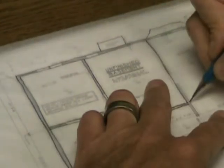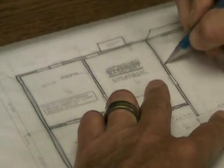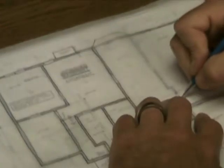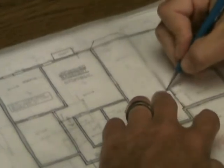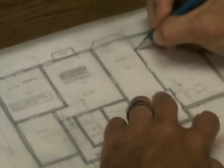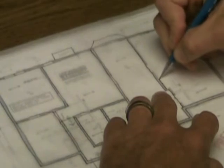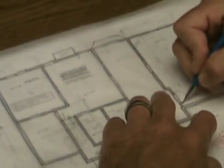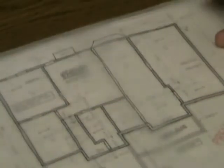You'll notice I'm putting this line directly over all the openings, whether it's a door or a window. I don't care about the particular details of how a door or window is framed. All we're looking for when sizing floor joists is just the bearing location, and that's why we can go right through them.